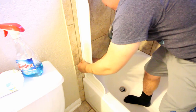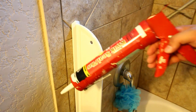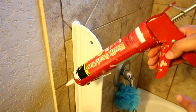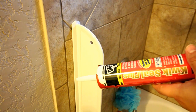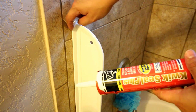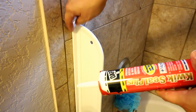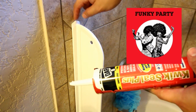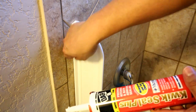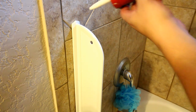Because my house has some issues and the wall is not even, you can see I can pass things through a gap — that's not a problem with the product, it's the wall. So here's my secret weapon: I'm going to take some caulk and caulk the gapping. It's not in the instructions, but because this is double stick foam tape, over time it's going to accumulate moisture, soap scum, and grime and get moldy. I also want to seal that spot where I was able to pass things through.